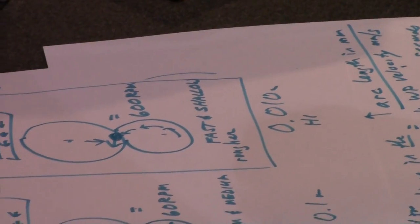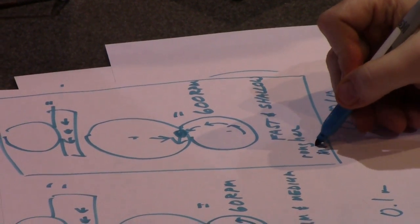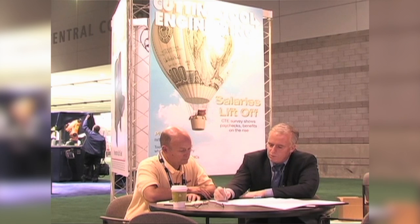It's going to be steady. And my form is probably going to wear away a little more quickly, so we're probably going to get more wheel wear. But your issue is not wheel wear. It's burn. Speed things up, you'll be okay. If you're worried about surface finish, spark out, you'll get that in check. But during roughing, if we've got burn issues, let's crank up that workpiece RPM.